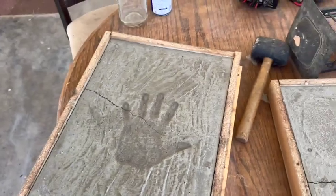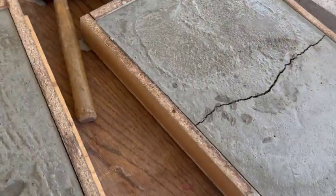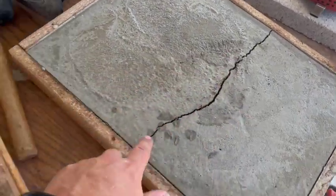Okay, it's been a week. The first set that I did, I thought was going great. A few hours into it, they had a big crack because I'm dumb, and everything I've learned about doing concrete with the wall in the backyard and everything like that, I forgot. My brain was stuck in, hey, let's try this and see what happens mode. And I let it dry too fast. It was hot and windy that day, and the concrete cracked and whatnot.